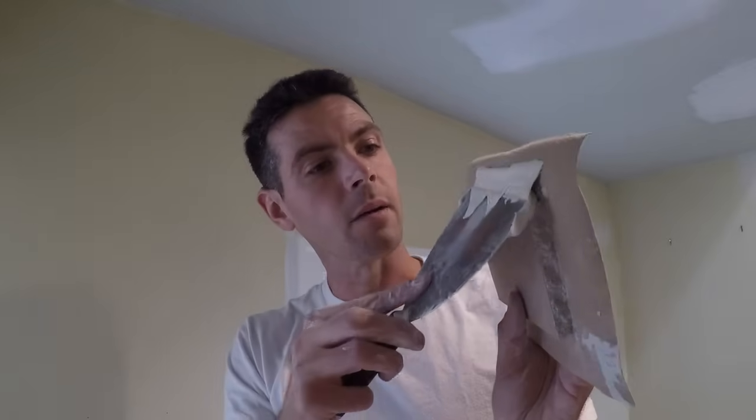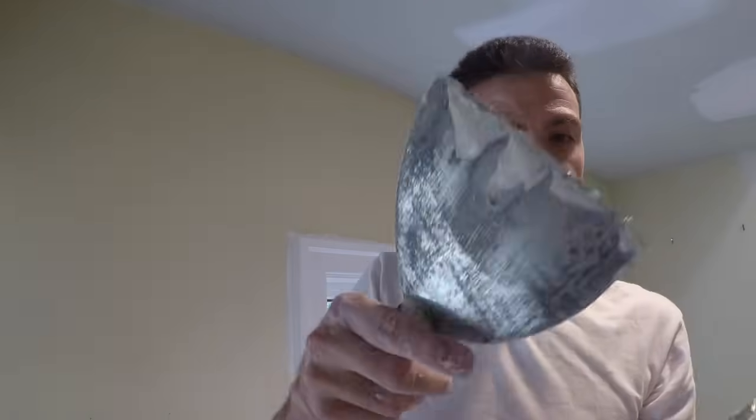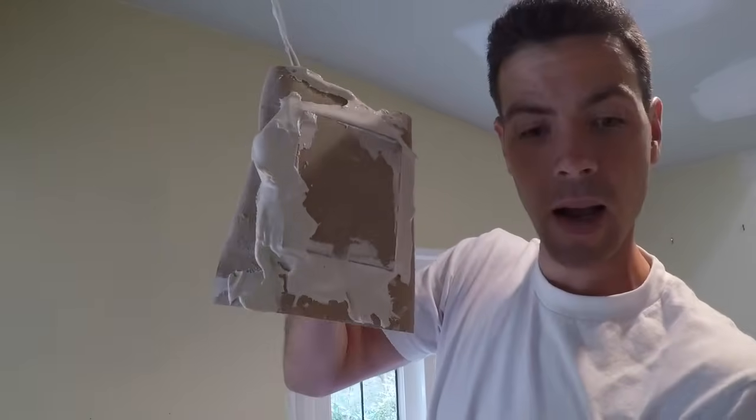I take the patch on the back side of it and I wipe mud in the corners, because where you get a blister is in this little gap where there's no mud. So instead of trying to make it too tight, which you'll never get, what I do is I know that I'm gonna make it a little bit big, and I fill this part with mud. And that way, there can never be a blister there. And it also makes the joint way stronger because you're gluing the sides of the patch together. So, there we have it. My mucky little California patch.